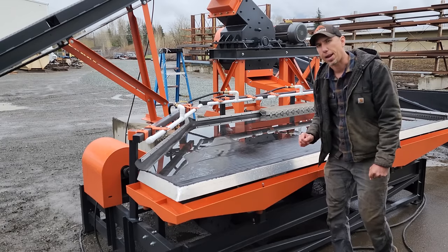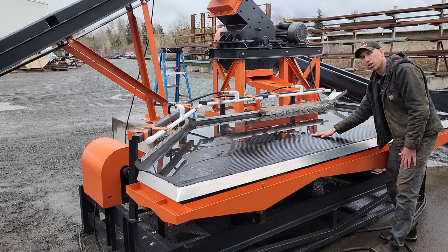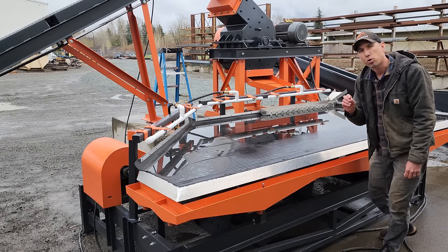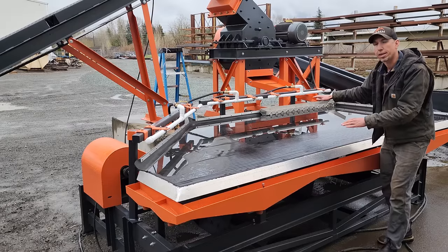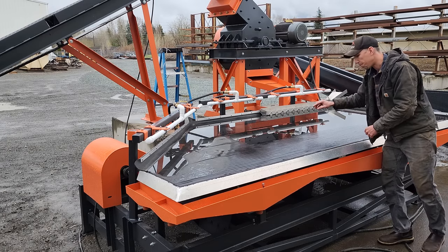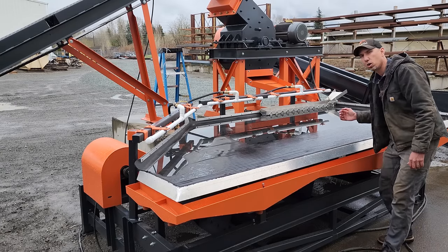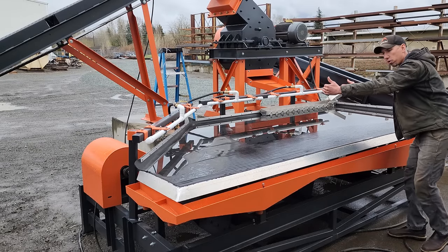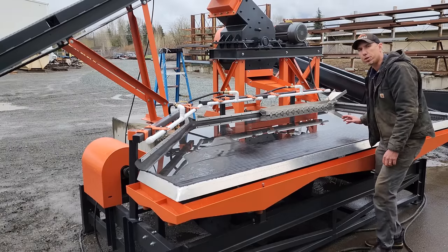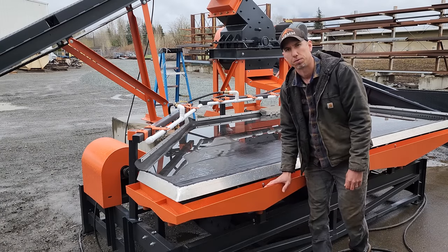To get the shaker table set up, it needs to be flat, level, parallel with the grooves, and tipped down towards the number four tailings trough at 1/4 inch per foot. And so when you get it all set up on this table, you have about an inch difference from the top to the bottom, 1 1/4 inches roughly. And it's, like I said, level this way in parallel with the grooves. So the water runs down towards the shaker table, number three and number four, and the heavy materials work their way across the shaker table, up the ramp, and into the number one and the number two.